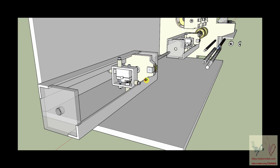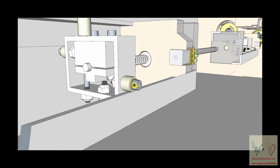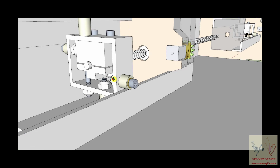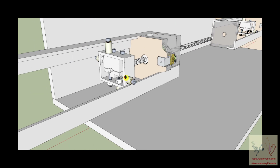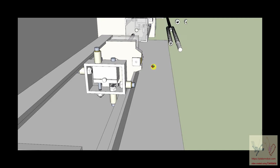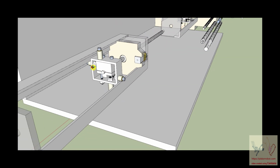And these are little tiny, really bushing bearings. This doesn't really move that fast. This is a high density polyethylene wrapped around an oil impregnated bronze bushing. But you know, if this is taking on heavy loads, these can be converted to ball bearings if they have to. It just increases the cost. But the fact that this is stabilized from up and down and right and left decreases the probability that it will be distorted, and that's important.